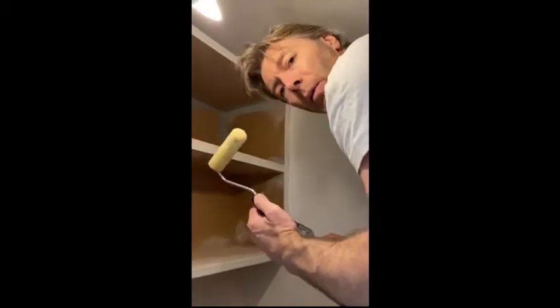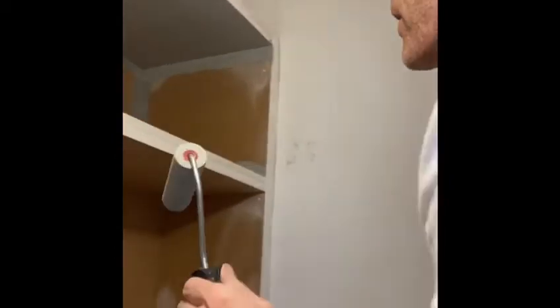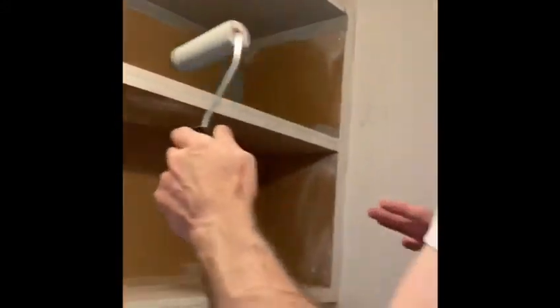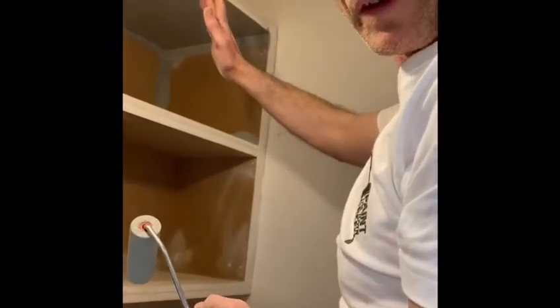Okay, that's our edges done. Now we're going with a roller to do the flat surfaces — I'm going to pour some into my Tupperware box. So that's the first bit of the shelf, that top bit, done. I'm not rolling on it so much that I start taking the paint off, but I'm doing it enough. There's no build-ups, no lines from the edge of the roller — it's gone out nice and smooth and evenly covered. I'm now going to repeat the process all the way down, starting at the top.